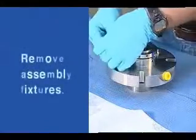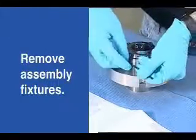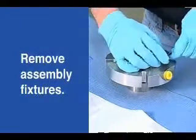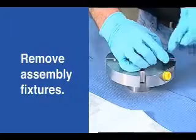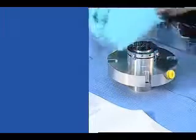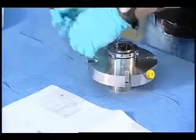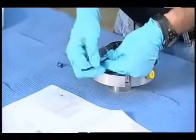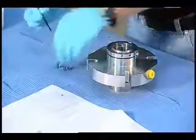Let's start with the assembly fixtures. Let's get all of these loosened up. For the purposes of this video, I'm not going to tag everything absolutely exactly as it was found, because that would take really some unnecessary time — you get the point. But we are going to tag the critical ones. The objective here is to not disassemble the seal as fast as possible and show off in front of the customer about how good we are with an Allen wrench. The idea is actually to inspect the parts as you go. So take some time.